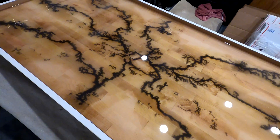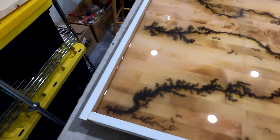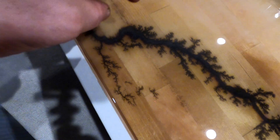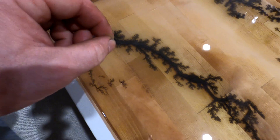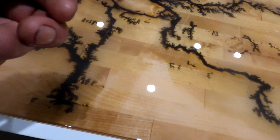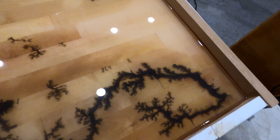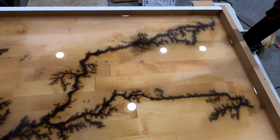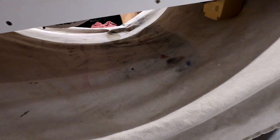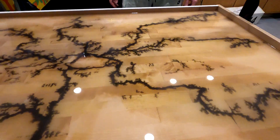It looks like our math was pretty good — we've got about a quarter inch of epoxy out of our pour. We've got a little bit of aeration going on, these microscopic bubbles entrained in the epoxy, but they will work their way to the top. As they collect near the top, we'll hit them with a heat gun to give us that nice clear finish. We do have a sheet down here in case we get any drips through any of our fiber optic holes.